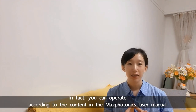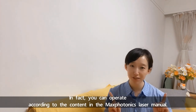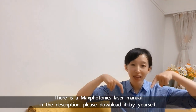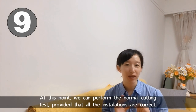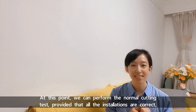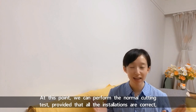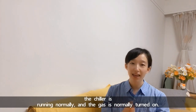In fact, you can operate according to the content in the Maxphotonics laser manual. There is a Maxphotonics laser manual in the description. Please download it by yourself. Trust me, it's free. At this point, we can perform the normal cutting test, provided that all the installations are correct, the chiller is running normally and the gas is on.